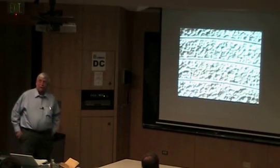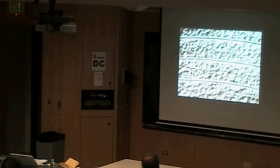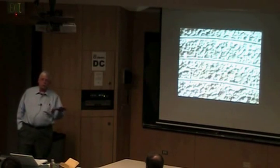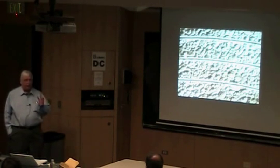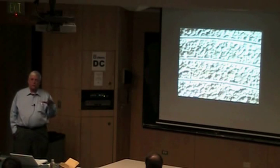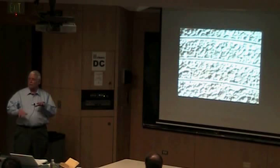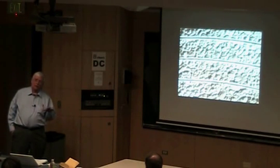But how do you make a surface like that? That's what's interesting. A lot of possibilities that we considered and dismissed. What worked was, I'll make it sound simple because I'll tell you the answer right up first. We had an original ruling, which I think was on either aluminum or bronze. That ruling was electroformed to make a tool that was used to press plastic, and you can alternate as much as you want between part geometry and tool geometry.